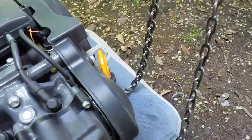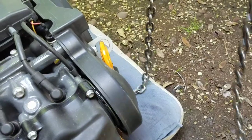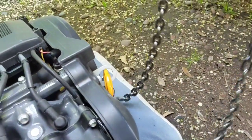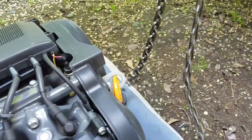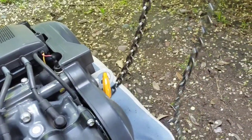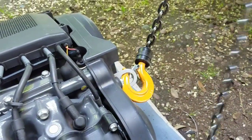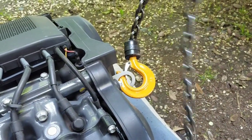Let me show you how this works — it's on a gear reduction system. I think I was pulling the wrong one. Pull this one — there we go, makes a different sound. It uses gear ratios to allow you to lift more weight. So you can see I'm just pulling in the right direction and it's slowly feeding into the block and tackle, very slowly lifting the weight. I'm going to use both hands here.